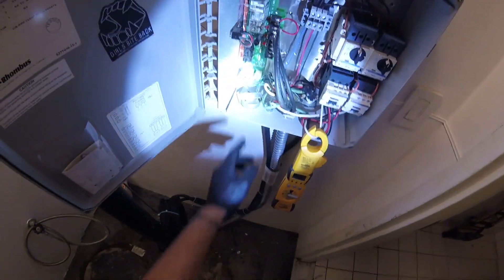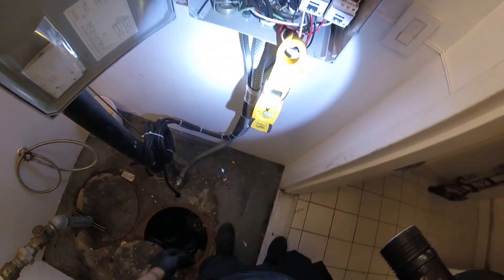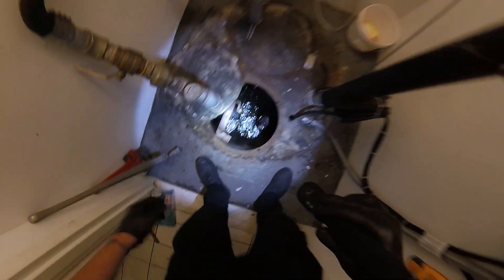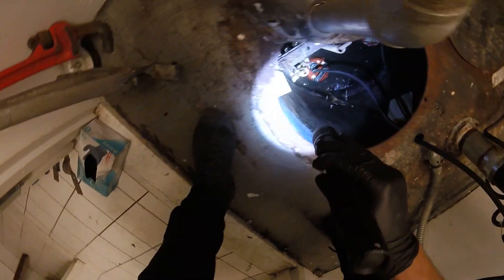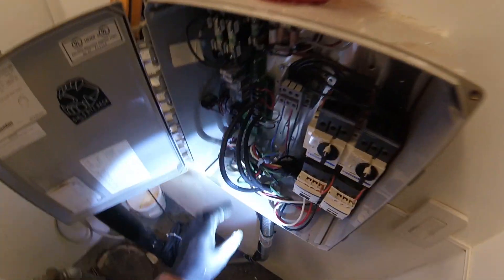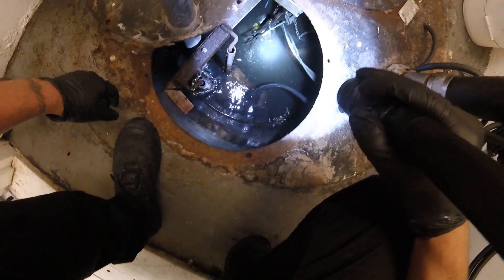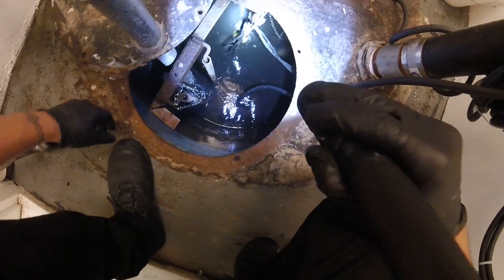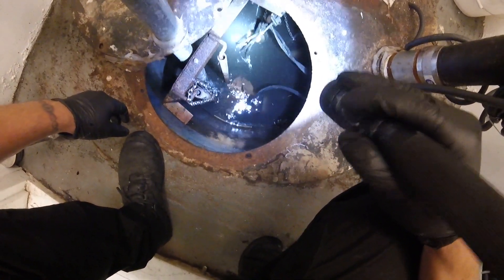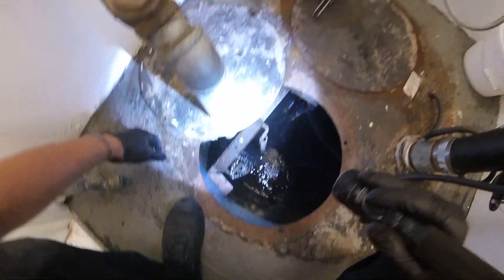What you really want to make sure is that you get the rotation correct — you want to get the phases right on this pump. But that's about it. We're pulling amps, you can hear it running, and that should be the deal right there. We're in automatic operation, you can see the light is on, the pump is pulling. You can see that the pumps are actually submerged. Those are the floats — you want to see if it works automatically with the floats. There are 3 floats down there, and we're running.